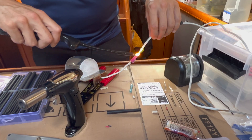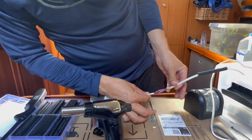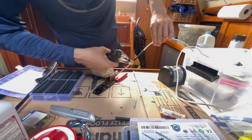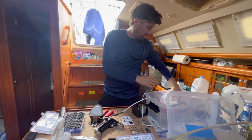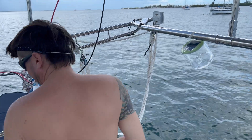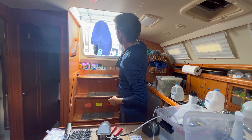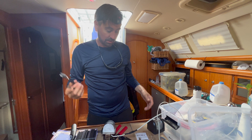This is my favorite part. That's the connection — pretty tight. The heat shrink goes over it, placed in the middle. It comes in a 2-to-1 or 3-to-1 shrinking ratio. That looks much better. The reason they had the old connector is it was a quick disconnect so the dinghy davits could fold in — you could pop them out and back in when docking. But because our solar panels are going over the davits and we're using that as a support, it makes no sense to have a quick disconnect. So it's permanently wired in now. Time to drill a hole.